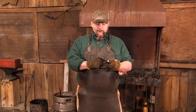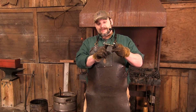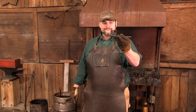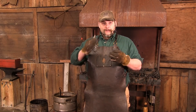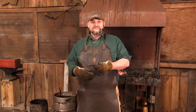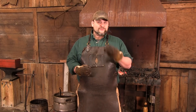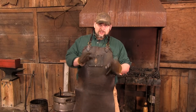The fluted area can't do anything for us, but there's a solid shank up here about an inch and a half. So what I'm going to do is cut this off, take that piece, and tip this piece of half-inch mild steel with it - weld it in really good, then forge it out into our point. That way instead of an all-mild-steel piece, we have a mild steel shank but a high speed steel tip. If you tried to buy a piece of high speed steel big enough to make the whole thing you'd probably break the bank, but if you can find a shank at least a half-inch thick you can have your very own high-speed-tipped punch for little or nothing if you've got access to a welder.